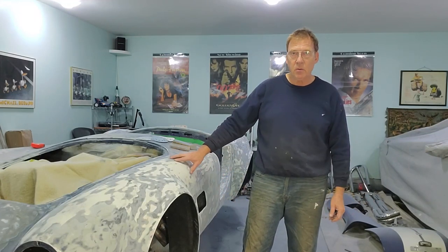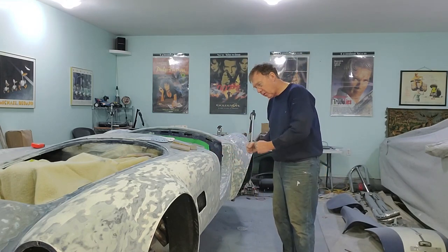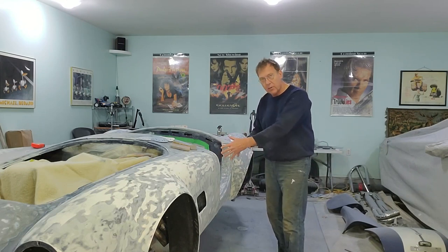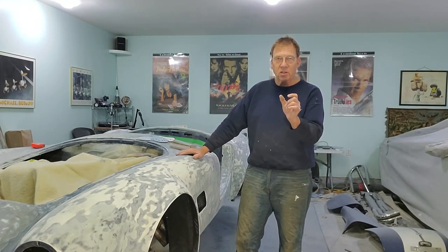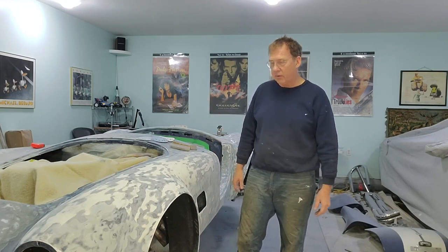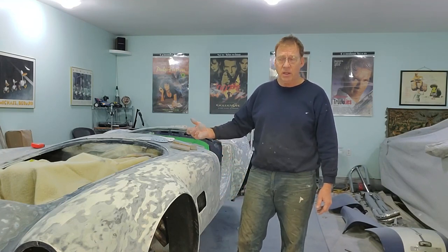That's it for the video — just a quick update on the bodywork. We're going to change those hinges, that's why I have them out from the doors. Once those hinges have been replaced and they're solid, you align it all, close the door, make sure everything is the way you want it, and then you can do the bodywork with the body and the door in place — because you want to make sure that's flat as well. You wouldn't work on a door separately from the body. We have to make sure the doors are on and the hood is on too because we need to blend the hood. The trunk has got one-inch-thick wide steel bars on it — fantastic — so I don't have to worry about the trunk hinge. I'll probably work on the hood and door hinges for the next few days since we've got terrible weather coming. Hit the like button and I'll see you in the middle of next week when we finish sanding the car and can actually start assembling it.